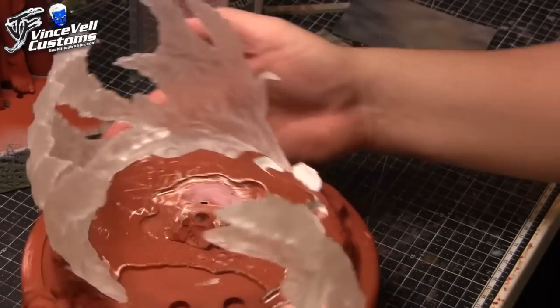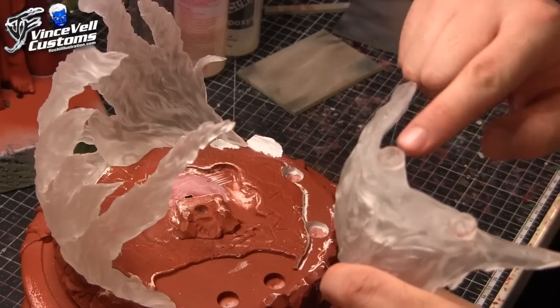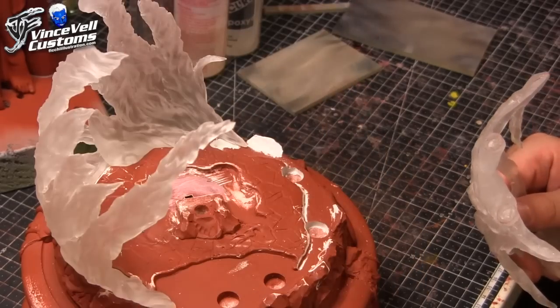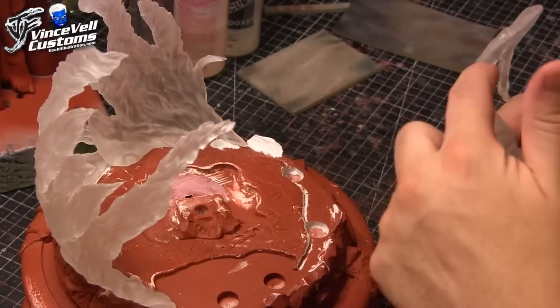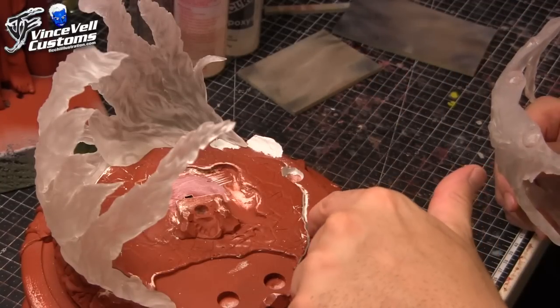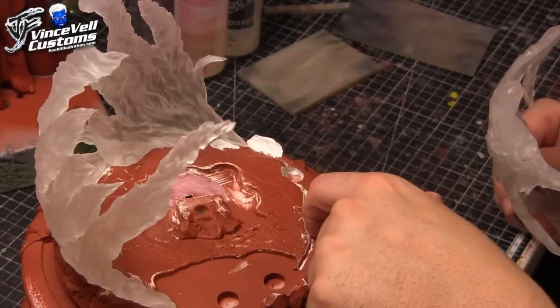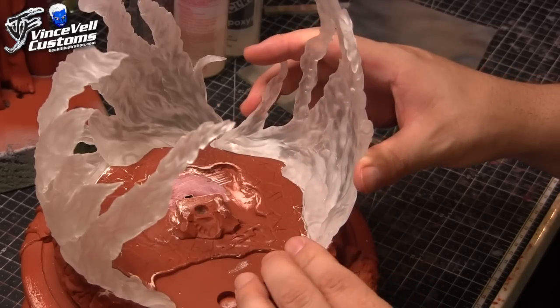So what I'm going to do now is, I Dremeled out all these nice little tiny holes in these pieces here, not too deep. I have these magnets here. The idea is we're going to put some semi-strong N52 magnets in here, let them set up, and then we'll try to put some stronger magnets in here if we have enough meat in these holes. This way, when we're done, these will just snap into place like so.